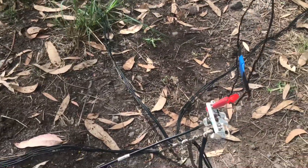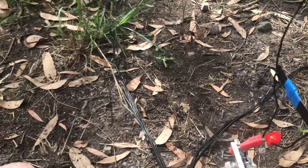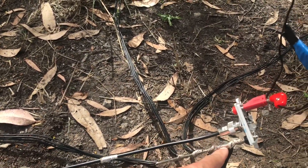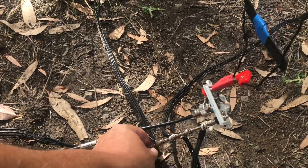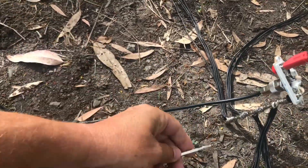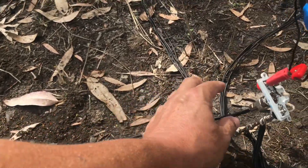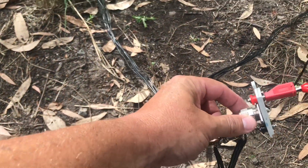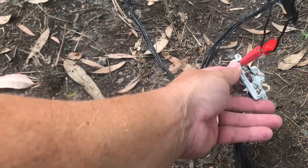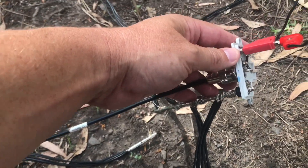Here's a closer detail of the antenna feedpoint. You can see all the radial ground wires — there are five groups, and they're just on piggyback connectors here. They just pop off like that and piggyback into each other. That's the PL-259 connector here. I've got this old lid from an electrical junction box that acts as the separator, spacer, and insulator.